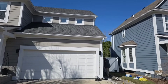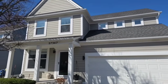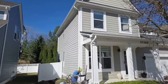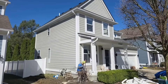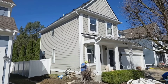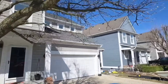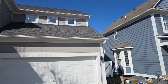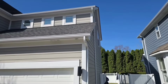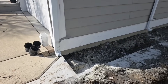I wanted to point something out: we've got a gutter on the second story with a downspout there. This gutter goes across the entire front of the house — on the other end it's the same trough, so you have another downspout here and another downspout here. That's three downspouts connected across the whole length, and then across the entire front. They're two-by-three, so we know we're not going to get a ridiculous avalanche of water, but we're capturing all the water off that second story.